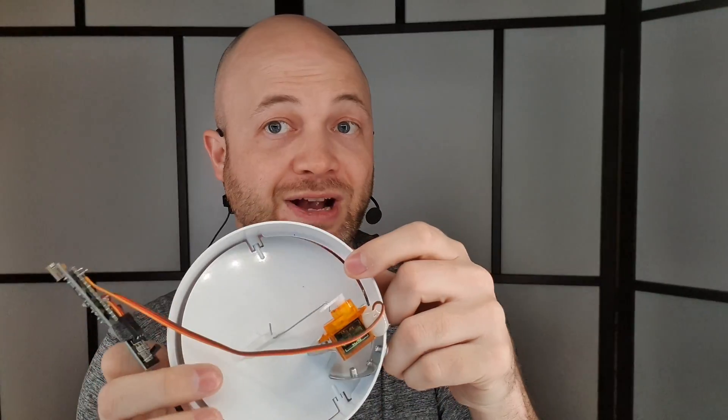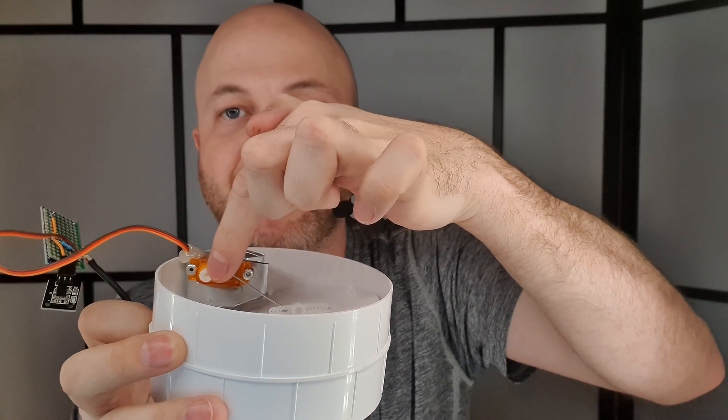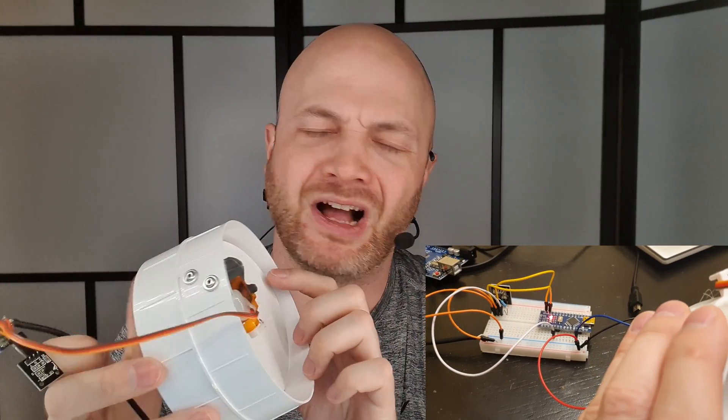This little guy here doesn't take a lot of power, but that big guy over there does take a lot of power. I've actually got them wired up so they're taking power from the USB cable and not through the Nano, because the Nano can't really supply that much current. But it can supply the pulse to control where to set the servo. You can set it anywhere from zero to 180 degrees. I've actually got a horn that's kind of glued to the top of that louver, and by adjusting where the wire is — whether it's far out or close in on the horn and far out or close in on this arm — I'm able to choose how much distance it moves, how wild the swings can be. I did mock this up with some foam core board just to try it out and see if it would work, and it worked really well. Hot glue didn't survive in the register for very long — it wanted to pull off. So that's why I've got this sheet metal and I've got it riveted into the louver.